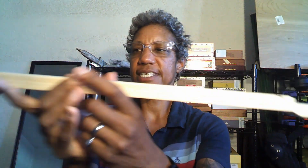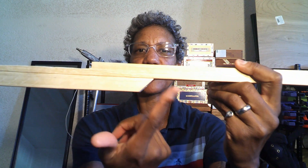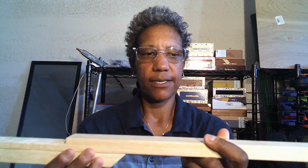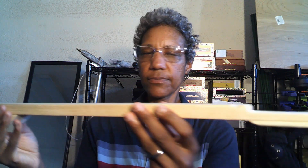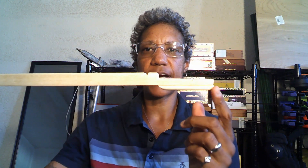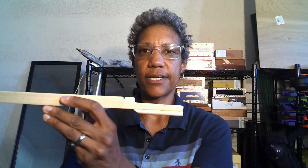You see how this is angled down right here? Both of these angles - I was able to cut these 45-degree angles very easily with the tabletop saw because the cast iron plate can actually turn to 45 degrees and you can make cuts up to that degree and everything in between. I was able to do that with this bottom piece of the headstock as well. All I did was take the area I cut out, shaped it, and just slapped it on the bottom with more wood glue.